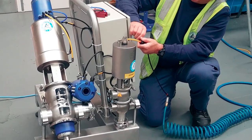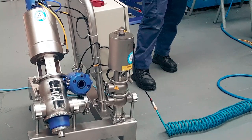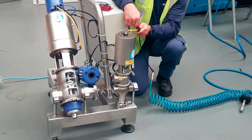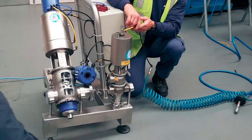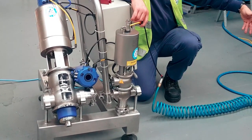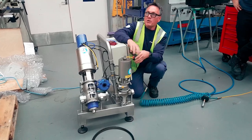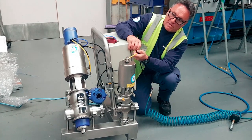Watch. The tap has to be in good condition to do that, but it's sitting there and now it's halfway. We're waiting around just chewing the fat, waiting for all the water to drain out. If the water is in here, I've only got this time for it to drain. 5 seconds. Do you understand where I'm going with this? So I've got a tank that's full of water. The butterfly that I'm meant to service might be passing, so there might still be water through there, might have a bent spray, the seal might be stuck, I've still got a full volume of water. I want to empty that tank, right? If I keep sitting there all day doing this, I'm only moving a certain amount of water, so to basically drain it, I'm going to pop my tap up halfway, and sit and wait.